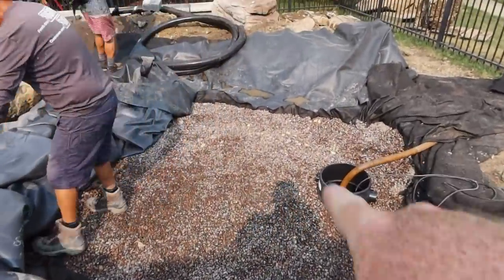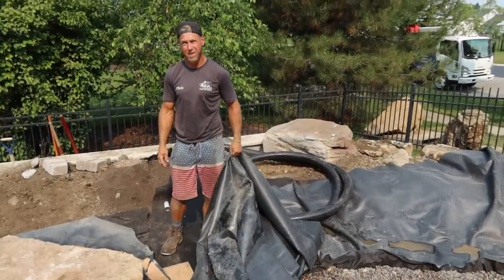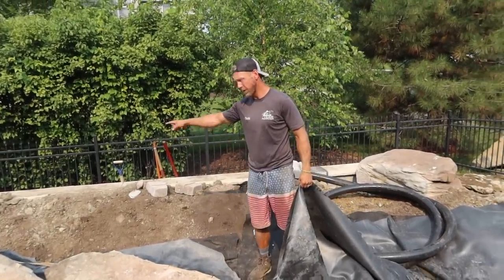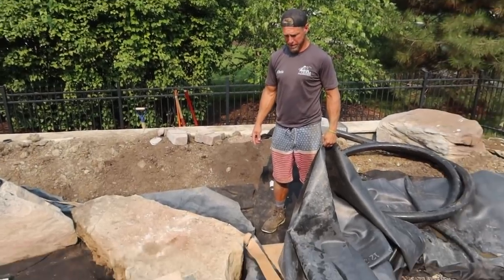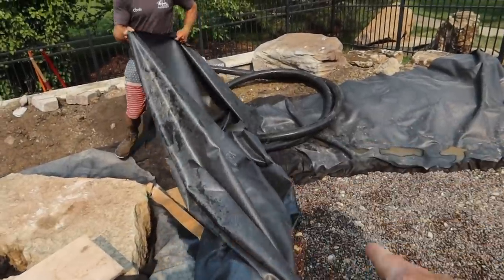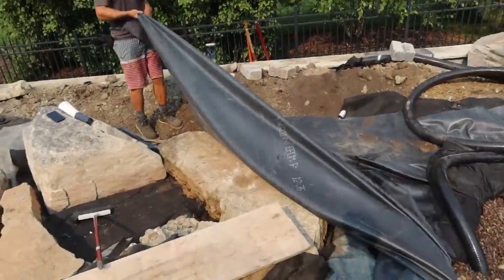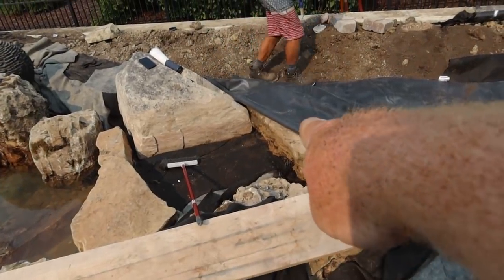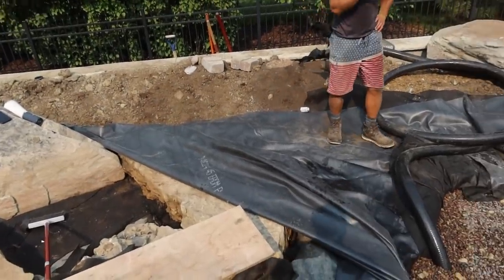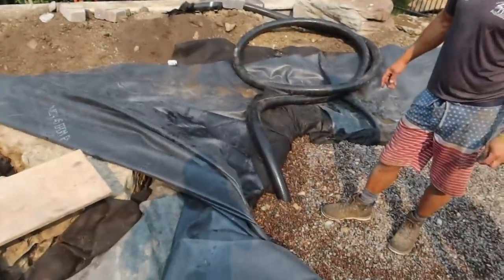You can see we've got our final layer of gravel in here. Jack went to get a little bit more red flint. Chris is working on what is probably the most difficult seam. We've got our four-inch cover tape down, and plenty of liner from our wetland to come back over it. We're going to have to cut this to show this curved seam, which is going to be difficult. The reason we're seaming rather than just overlapping is because the top of this fall is only about three inches higher than our water level — so there's no way to do a comfortable overlap without it leaking.